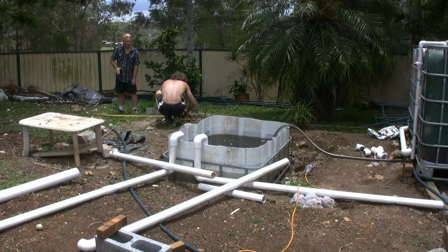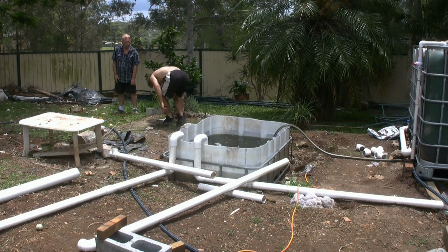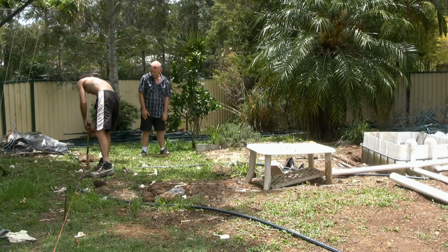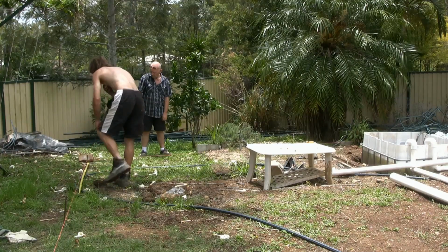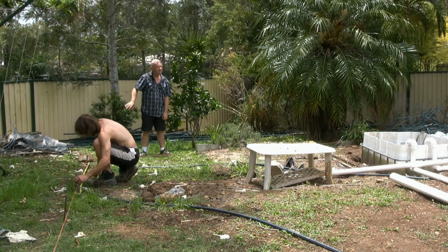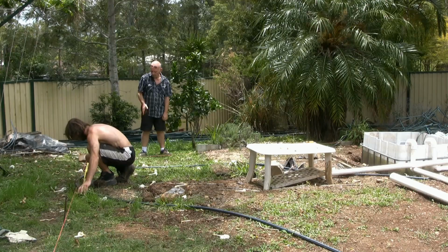So it's quite critical. When you cut your timbers, you'll see when you get all the way in, the post, that the board just slides down and fits in there nicely. Okay, you got it right. Don't be afraid to have somebody standing on where you take it, just to keep an eye to make sure the tape stays true. The last thing we want is to be a quarter or half an inch out, because sometimes that can make cutting and dropping into the slot quite difficult. And then you're trying to trim it up.